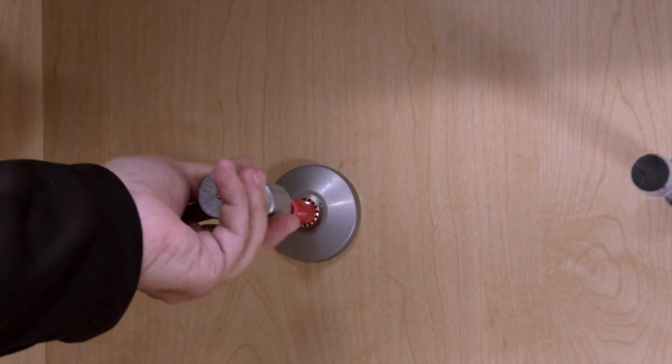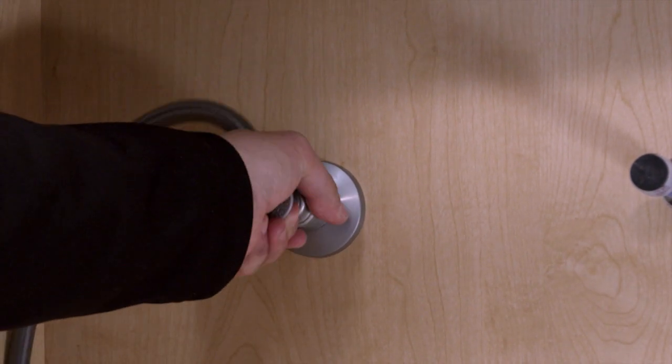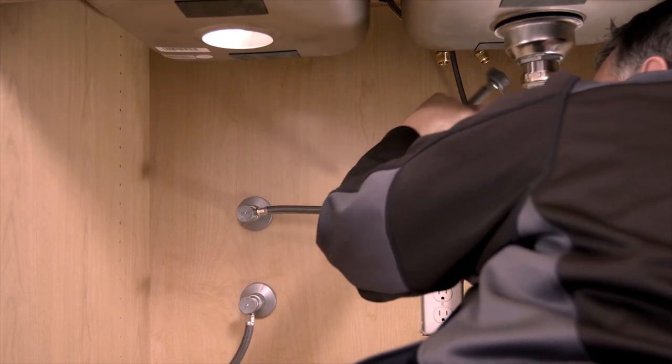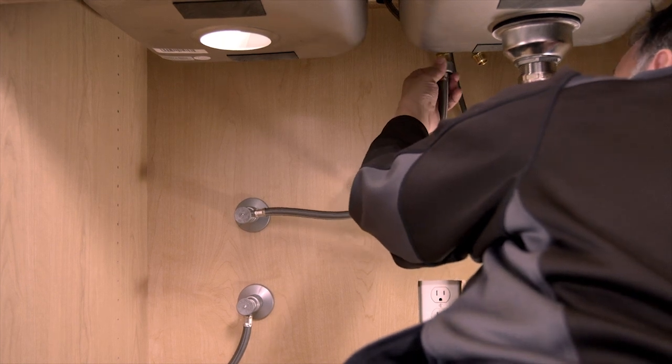While pushing on the valve, turn clockwise from 9 to 12. You can see the valve isn't stationary, which makes it easy to adjust its position so your connection doesn't kink. Then attach the connector to your sink, hand tighten the nut, and you're done.